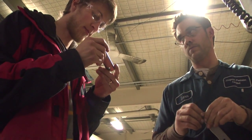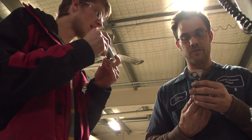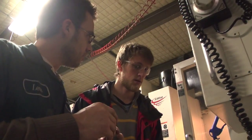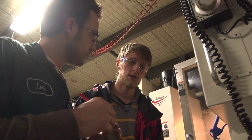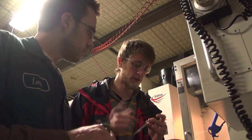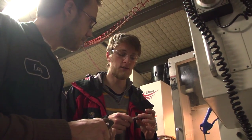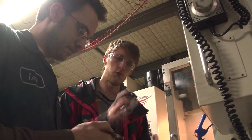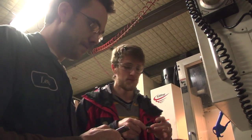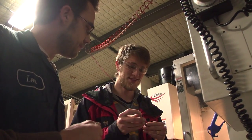The 3 thou, you won't notice by eye. No. But if you're trying to assemble something, if there's a pin going through two sides, you might want a little bit of play in between. It's not that critical. Like for my custom knife that I'm designing, I do ream them for quarter, and it just makes everything fit nicer. But these are production, you want a little bit of variation, right? Since I'm not designing everything. Yeah. You need to make sure it'll fit everybody or else you get complaints. And so yeah, that's good.